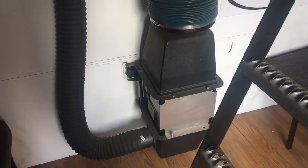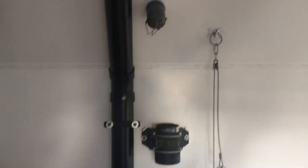So this is an American-made air filtration system that we don't use the bellow anymore. Now we use a hand crank. But the way this air system works, the air pipes go up to the surface there. The air comes in there. It comes down this 4-inch pipe, goes through a HEPA and a carbon filter, and then the overpressure goes back through this valve up here in the middle of the screen right there, the one on the right.